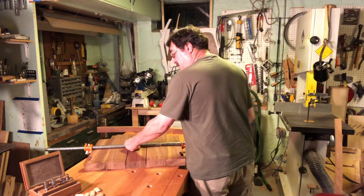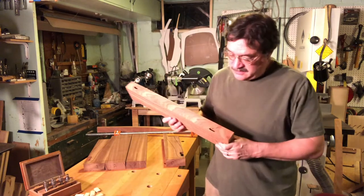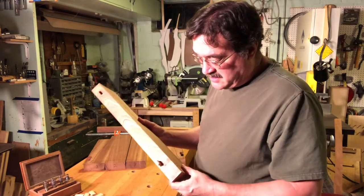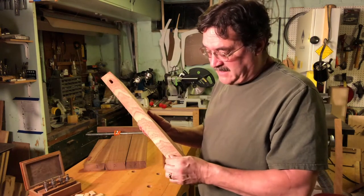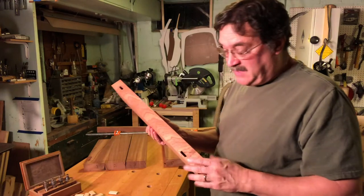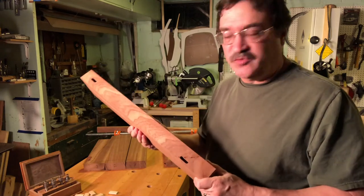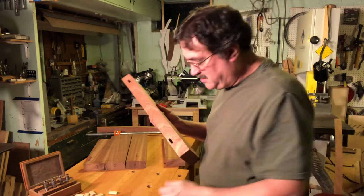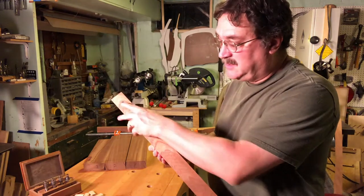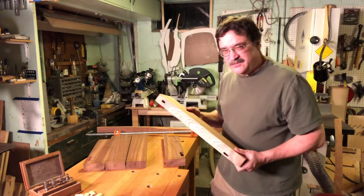Some other things going on in this chair: I have cut slots in here for floating tenons — they go right in like that. They do increase and reinforce the strength of the butt joint, but that's not the primary reason I do it. The truth is that's probably not necessary because modern wood glues are so strong you really don't need these reinforcement pieces. But what it does do, besides reinforcing, is allow a perfect alignment for glue-up, so I get an absolutely perfect glue-up with minimal effort and zero chance for mistakes.